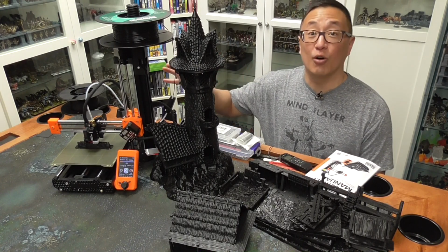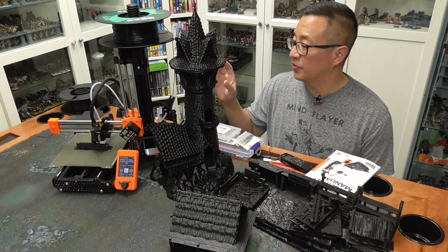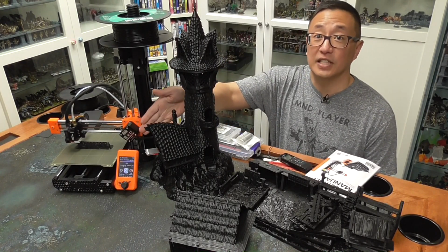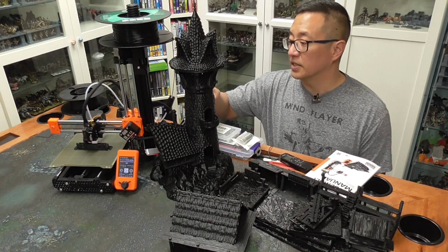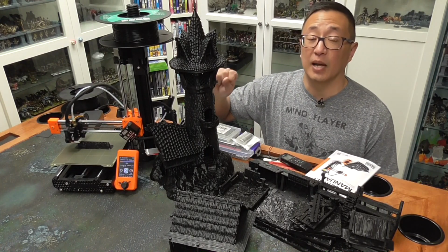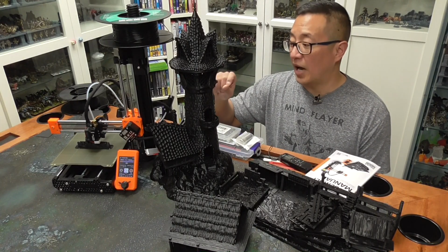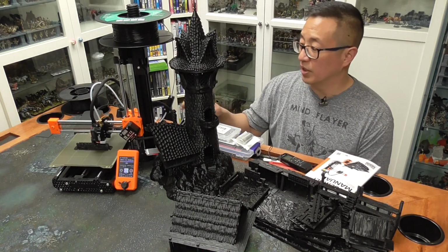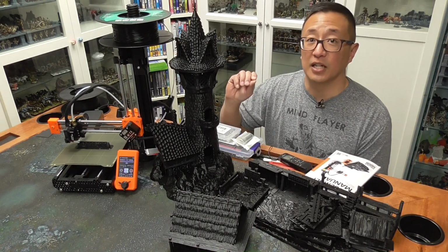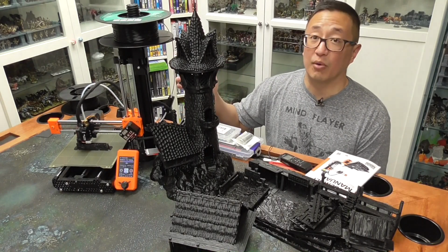4 to 6 days later. All right, so it took me about an hour to put together this pre-assembled kit. And honestly, 15 minutes of that was fiddling around with attaching the LCD screen. And that really is the only complaint I had about the build, was that the screw that they suggested, the M3 by 12 millimeter screw, is too short. And so I needed to jerry-rig the 20 millimeter, the medium size bolt that came with the set, and had to put on 2 nuts in order to shorten it. And so that was really the only trouble that I ran into putting it together.